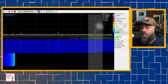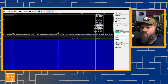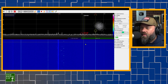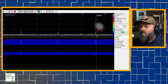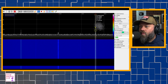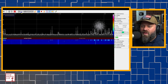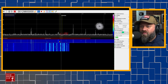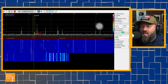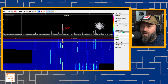Here's the military air band. Turning the bandwidth back down to about 25 kHz. You can see the 1.25-meter ham band with not much activity there. Scrolling up, the band plan goes up to about 6.828 GHz — that's about as high as it goes. It's kind of fun to tune around and see what's going on. If you're getting weak signals you can decide to get a better antenna for monitoring whatever band you want.